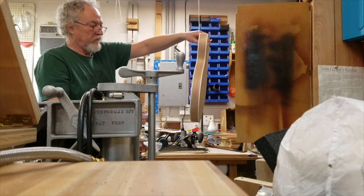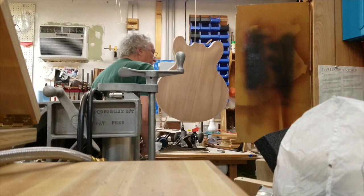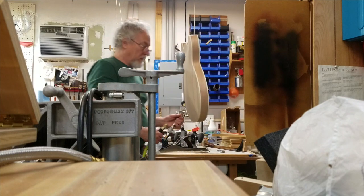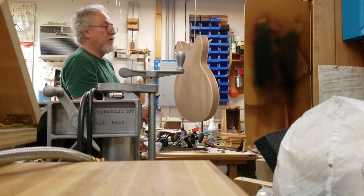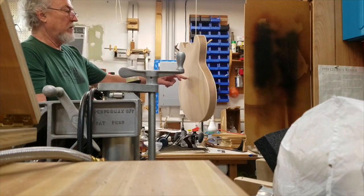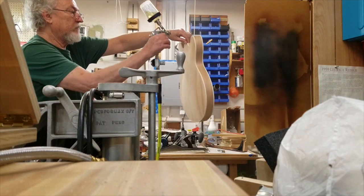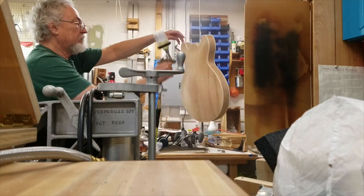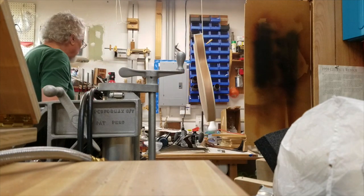Like it was said, we did a black stain, sanded that back, which I did by hand, and then one coat of undiluted blue dye from Jack Goddard. So this literally is natural sides. The top has three levels of stain on it: two blacks, sanded down, and then one blue.